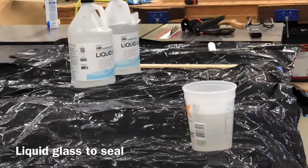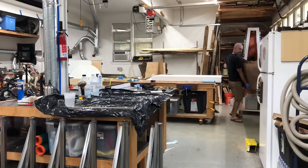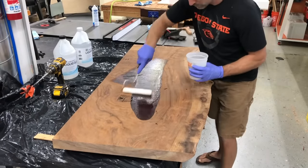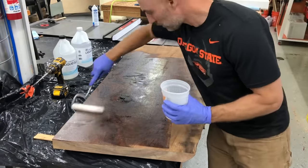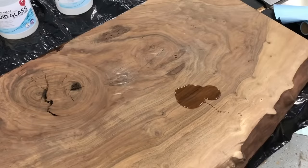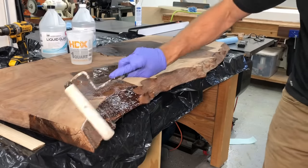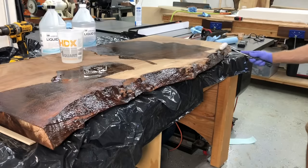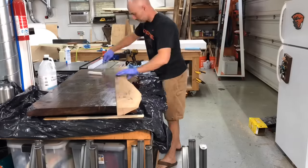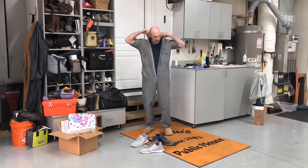Sealing the edges or not sealing the edges seems to be a really hot topic issue in the epoxy table world right now. I know the Black Forest guys came out with a video saying never to seal your edges because they had some tables that came apart after sealing their edges, and I totally respect that. I know Dylan pretty well — I've talked to him about this quite a while before he came out with that video. I still seal both sides of my slab. One reason is that when you make your pour and the epoxy goes underneath, the top can potentially warp from absorbing moisture from the air. I also seal my sides because I use this black epoxy and it can really soak in there and stain the wood. Generally, the Black Forest guys use a metallic pigment and that powdered pigment doesn't soak into the wood like this liquid dye does, so that is one of the reasons why I still seal my edges.